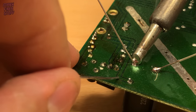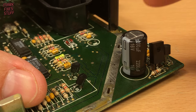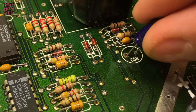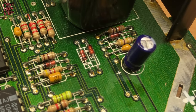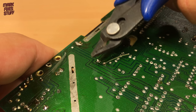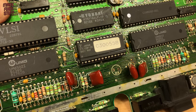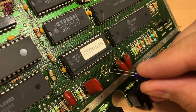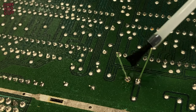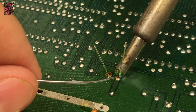This is where practice really helps — knowing your tools and your solder can make painful jobs a bit less awful. When you buy a new soldering iron, they'll often come with a tiny conical tip. These tiny tips are great for modern surface mount devices where components can be the size of a grain of rice. But for retro electronics, you'll often find that you need a larger tool in addition to your tiddler. You can buy a variety of tips for most decent mid-range soldering irons, so don't be afraid to experiment with different sizes.